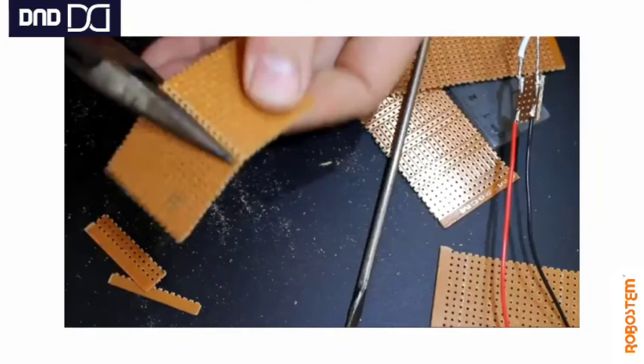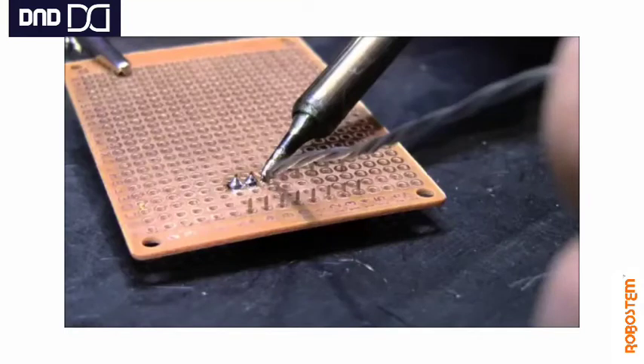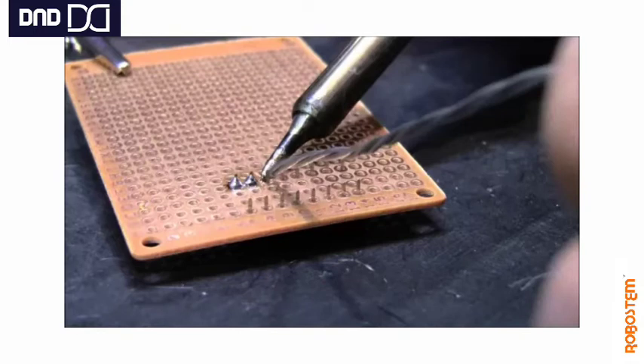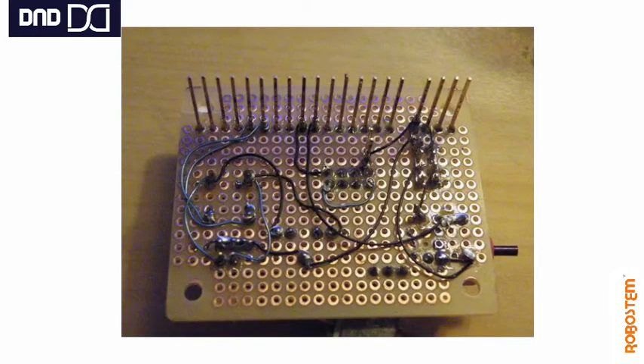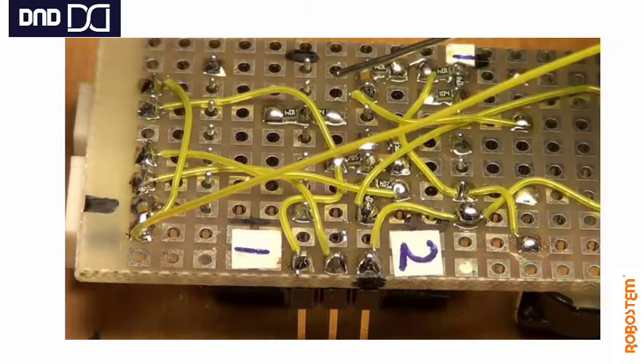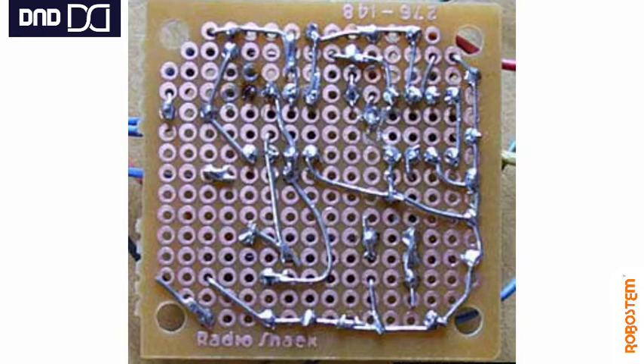Once you break it, you can solder it. While soldering, be careful that the solder from one component does not touch a nearby point. Put only a small amount of solder so it holds to the PCB board — no need for a large amount. To connect one component with another, you can use solder lead, a hookup wire cut to the required length, or any single-core metal wire.